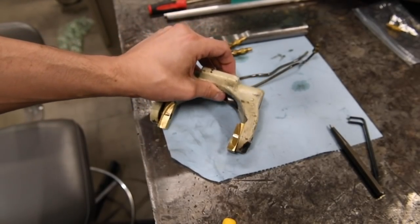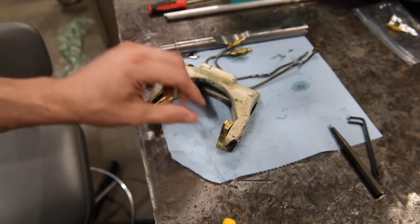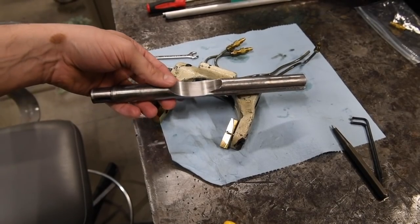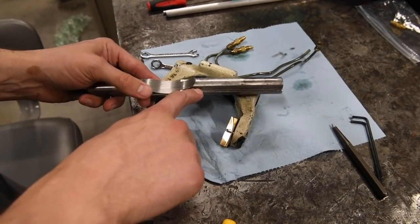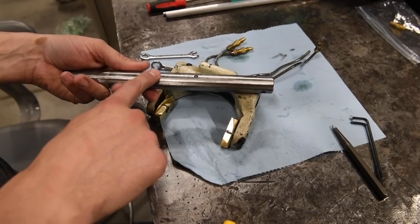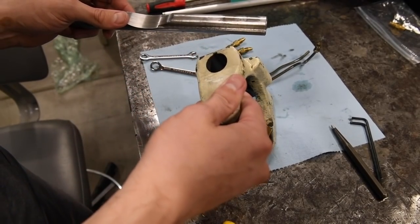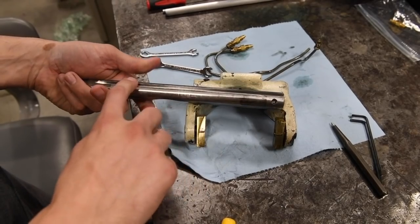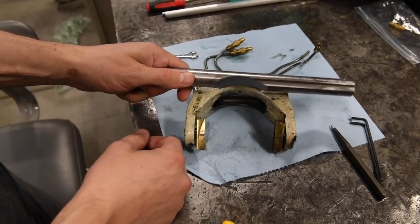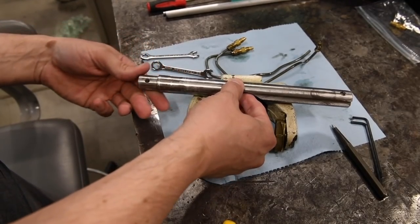That's the only disappointing part. The rest of this is what I was expecting to find. This thing is definitely a pain to get out - there's the shaft, pretty complicated little piece of material. I think someone else has been in here and milled out the sides here, I'm assuming to make it a little easier to get it installed and removed. There's the keyway that Monarch put in there, and then this is radiused out so that it fits in here and won't come in contact with the round housing part on the shaft.